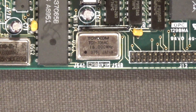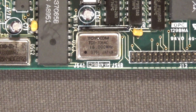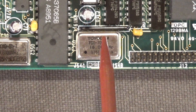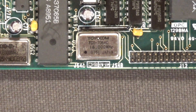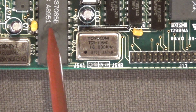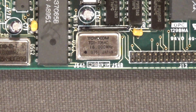I had a hard time finding documentation on this modification. It's like Commodore did not want people upgrading the processor on this 286 bridge board — they didn't want to go beyond 8 megahertz; they wanted to force you to buy their faster 386 bridge board. There's basically no documentation on this anywhere. I found it in one location accidentally — it was actually by Commodore — and that's how I found out how to do it. I always wondered why there was an empty space near the high density floppy disk controller chip for a clock crystal, and now I know.